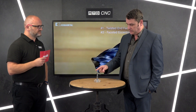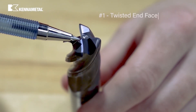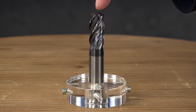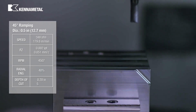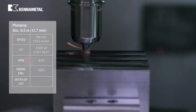The three main changes — the TE comes from the top where it's got a twisted end face, so we've got concave ends to the flutes here. The idea behind that cutting edge is it deflects the cutting forces, so instead of a true 90 degrees you're spreading those forces, and what that does is this tool can ramp at 45 degrees no problem — you'll probably see that on the screen — and we can drill or plunge with it almost like a drill, so it's very versatile in those applications.